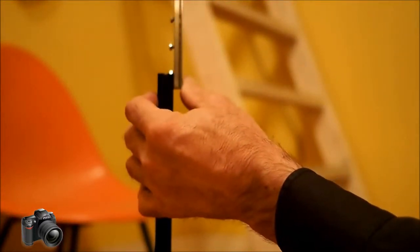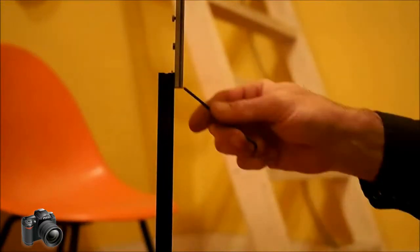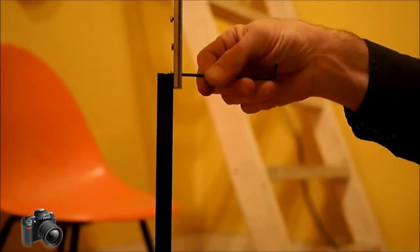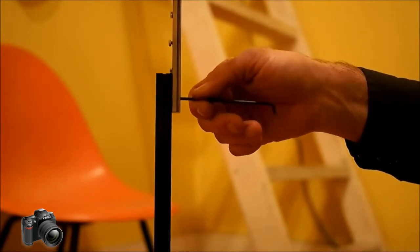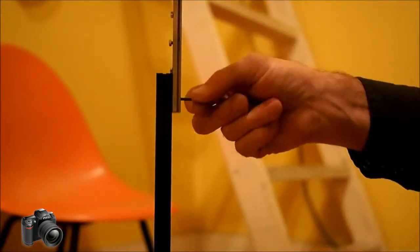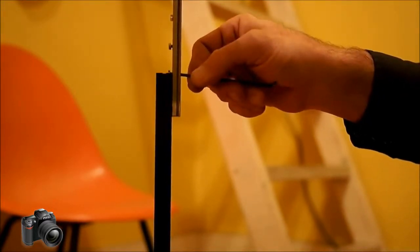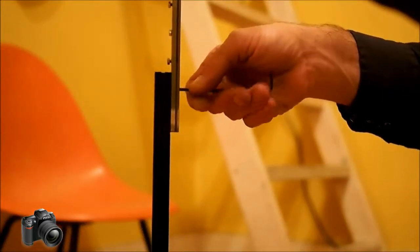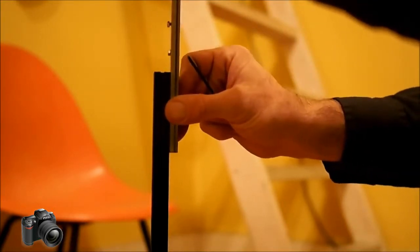You can see we're going to start that by taking each nut and unscrewing it a little bit until we get it on, and then once it's passed, screw it in some. Don't crank it down. You still want it to slide, but you want it screwed in enough to not have that nut fall off once it's already slid past. And you do that with all 16.